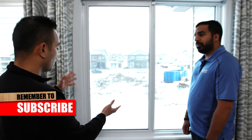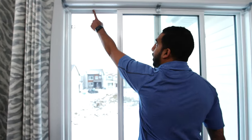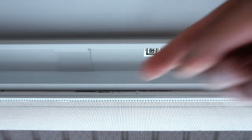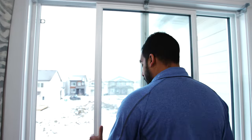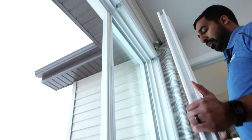So how would I go about cleaning it? First, we're going to unlock the window so we can slide it open and pull it open. You can notice that there are two anti-theft clips here. If we're underneath those anti-theft clips, we can't actually pop up the window. So we're going to make sure we're clear of those. We're going to lift the window straight up and pull it out. We're going to set it aside for now.